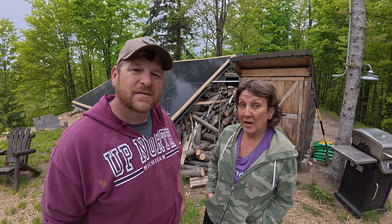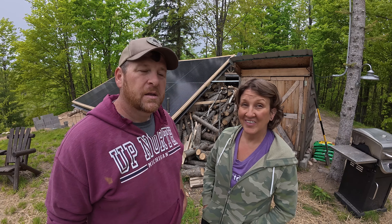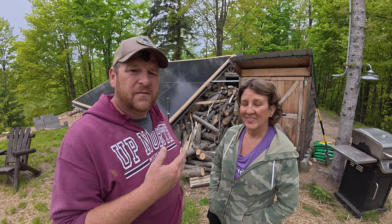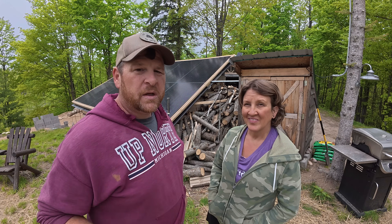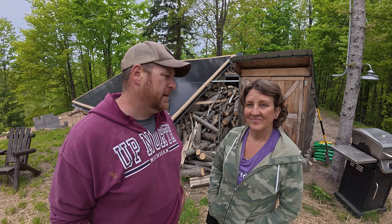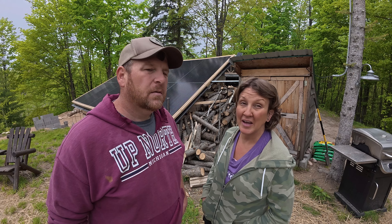This wind turbine would be good for a camper or someone who's part-timing it in a cabin running DC appliances — lights, small pumps like we're doing. If you're a weekend off-grid warrior just working on your cabin, this could get you by for a couple of days, and then recharge while you're away so your battery is full upon return. However, because our system runs a full-time inverter, that would deplete a 12-volt system quickly. We also saw a couple of these on boats in Florida — that would be a really good use case.